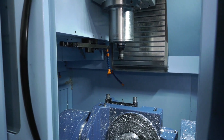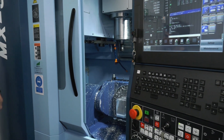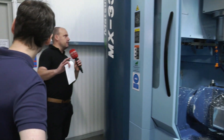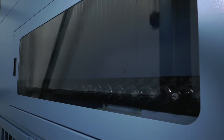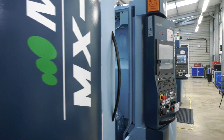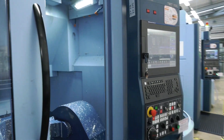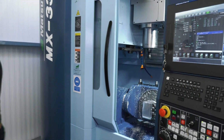Is there an opportunity to have sister tooling on the machine as well? That's correct, there is. And here you've got 90 tool stations. Correct. Compared to some of your other machines within the machine shop you've got a lot more options — most of the machines in this workshop have either 24 or 40 tools. Having 90 tools makes a big difference; it allows us to have common tooling on both machines, which speeds up programming and setting of the machines.